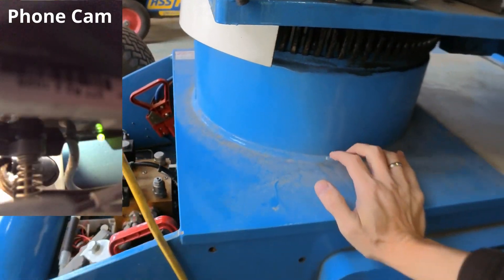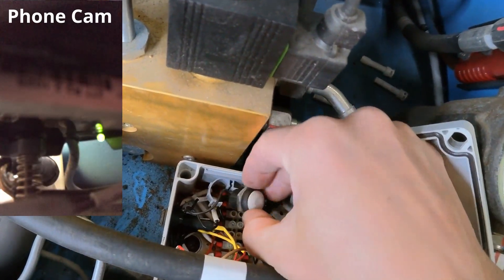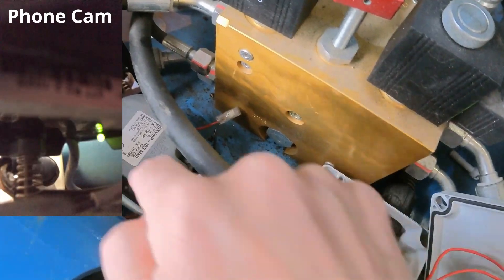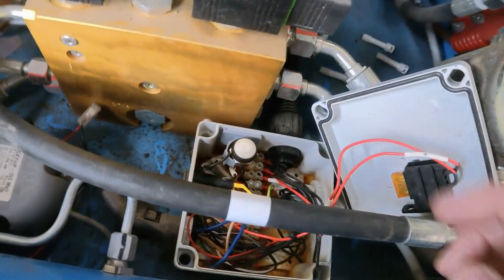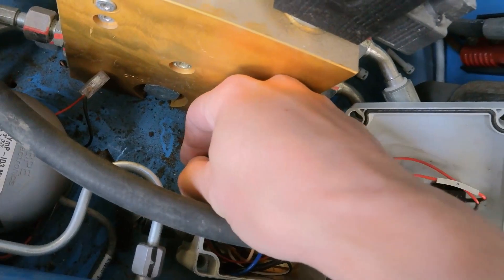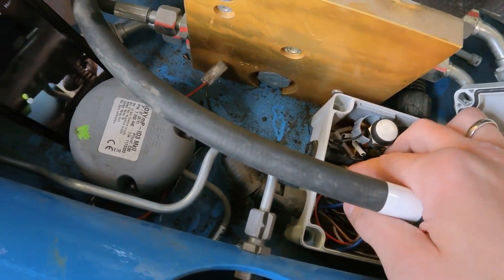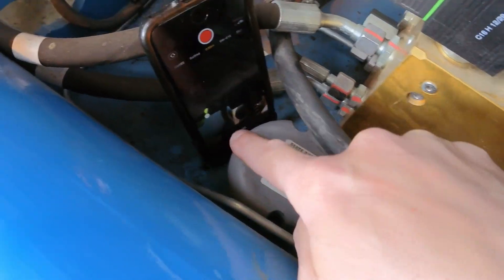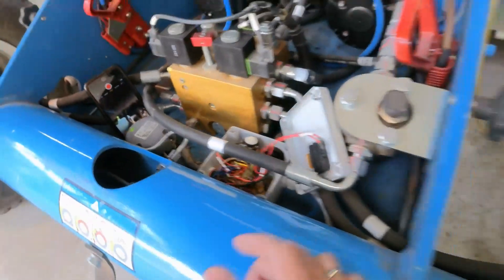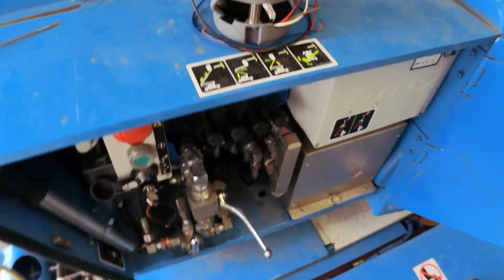That's all good — no problems. Sometimes it doesn't go in on the first go, just give it a couple of tries and it will normally calibrate just fine. Look for that LED because if you don't watch the LED, you'll never know if the calibration is going through. Also make sure the fuse holder here is fully tight, otherwise you may lose the connection to the power supply to the sensor. The LED is at the bottom — from the side you can see it, just where the gray cable is.